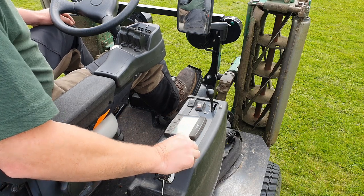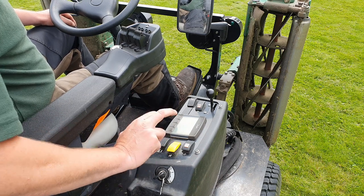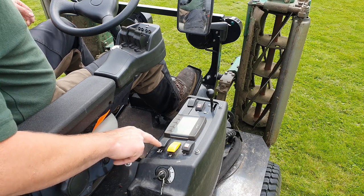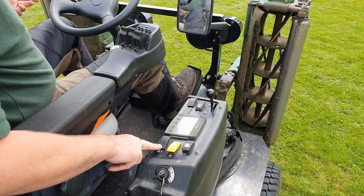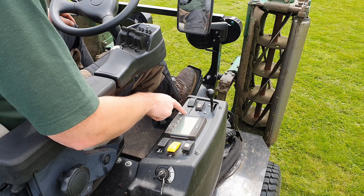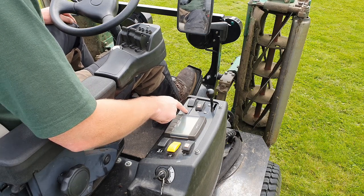Again, it's a positive lock — you cannot accidentally push that down; you have to push it the opposite way and then pull it backwards. The main button we use on the control panel apart from the parking brake is the reel cutters: forward is reels on and running, and back is reel stop and off. There's also a 4x4 in reverse button — if you're in a tight spot and the ground's a bit wet, you push it down and it activates the four-wheel drive and diff locks so you can reverse out without churning the ground up. This little blanked-off button — I don't know what that is. I'm sure if you've ever had a car in the 80s or 90s there was a lot of intrigue about blanked-off buttons, and obviously there's something available on these mowers that Ransomes don't want me to have — but I'll ask them when I see them.